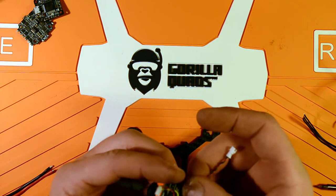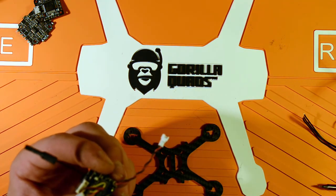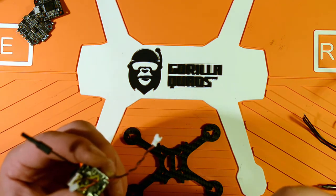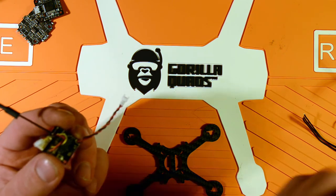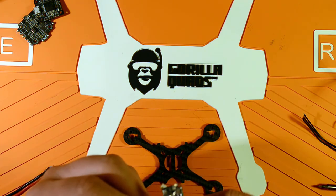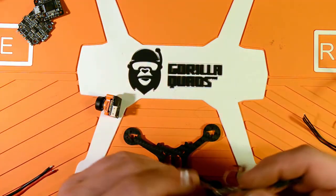It comes with little standoffs, mounts right there. This plugs into here. This goes to VBAT. Well, not VBAT, but I believe it's 5 volts. I don't know what the voltage range on this is. 3.5 to 5.5, so basically 1 to 3S. Nope, not 1 to 3S, but 3.5 to 5 volts. So there's that. I've already had it on this just to see the fit and finish, and it is nice. Apparently I forgot to put my screws back in that camera, so I'll have to do that before I put it back together. But this is another option.